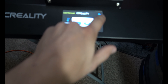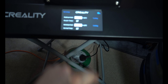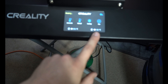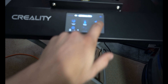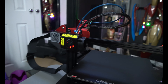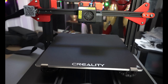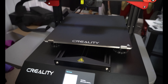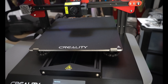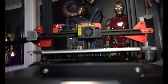In the temp settings, we can do automatic or manual, which is what I like. We'll do 215 and 60 and see how everything heats up. Turn the fans off — it is reading, that's good. Now we're going to go ahead and level, and that should start to move everything. My X moves, my Y moves. That is beautifully quiet already. It has a silent board built in with, I believe, the TMC 2209 smoothers. The loudest thing is going to be the fan. My BL touch is in active mode — you can see it's sitting in blue, which is perfect, which means it's working.